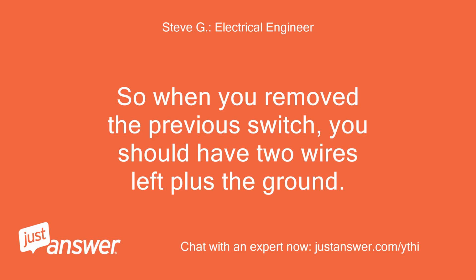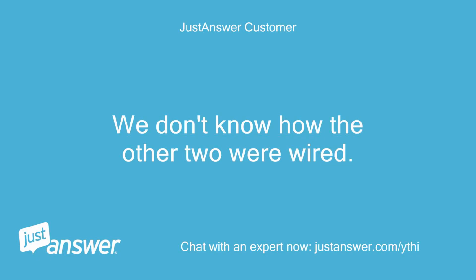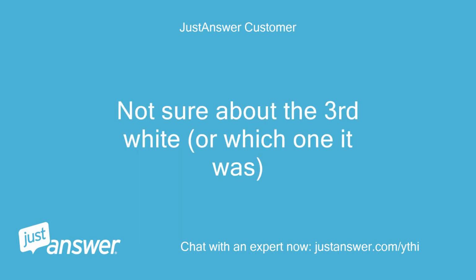So when you remove the previous switch, you should have 2 wires left plus the ground. What happened? We don't know how the other 2 were wired. Here's what we know. The 3 ground wires from the ROMEX cables are all connected. Black from at least 2 of the ROMEX cables were attached to the single pole switch. Not sure about the 3rd black, or which one it was. White from at least 2 of the ROMEX cables were wire nutted together. Not sure about the 3rd white, or which one it was.